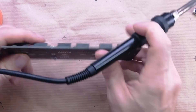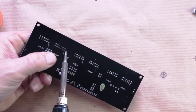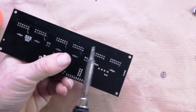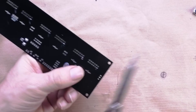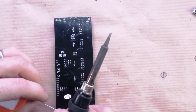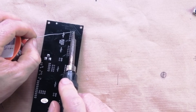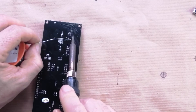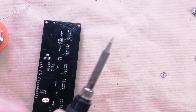I just find this the best way of doing it. They all look to be okay. If you find one that's not sitting straight, you can just put your finger on it and reflow the solder and push it down firm, but these all seem to be fine. Once you've got one pin in there it's going to be fine. Now I'm just going to solder the others — I don't think you need to follow this in detail, it's fairly straightforward. I'll go down one side all in one go and then the other. I'll see you when this is done.